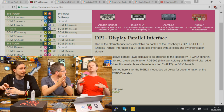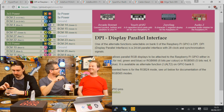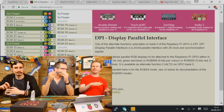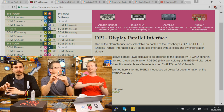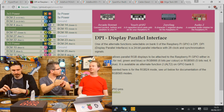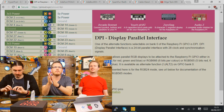Yeah, so basically the two lowest bits, the two least significant bits are wired to the two most significant bits, so that the black is the actual black and the white is the actual white, and then in the whole range from black to white, you only have 3 points where you kind of jump over. You have like a threshold, a transition across that threshold. You jump over 2 bits at once, which basically you can't see, so it's pretty smart.